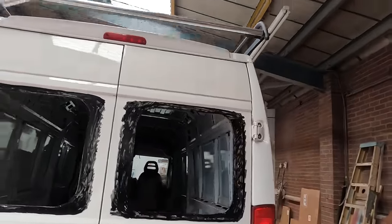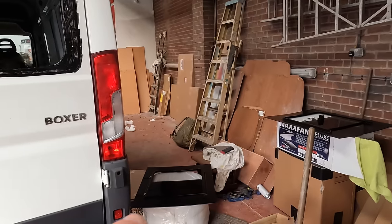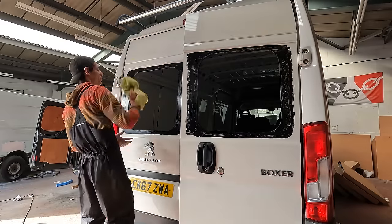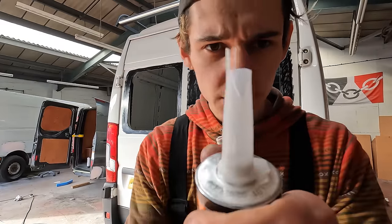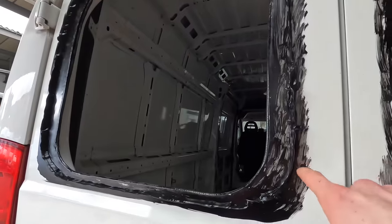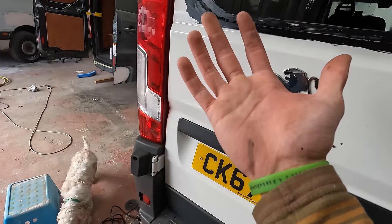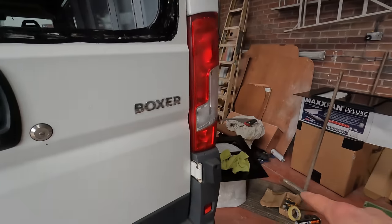Make sure you do the outside rim as well before you paint. Both are now painted and looking good — I'm going to wait for that to dry. Then I'm going to bead it up with silicone. If you look at the nozzle, it's got a V-shape — you put it against the surface and it gives a bit of length away from the paint and metal, and causes a V-shape bead as you go along. I ended up with a dodgy gun that bruised the back of my hand, but we've run a bead round here now — all good.